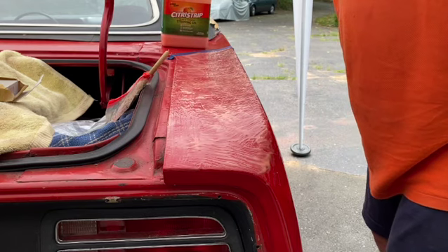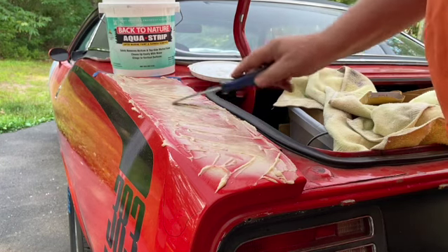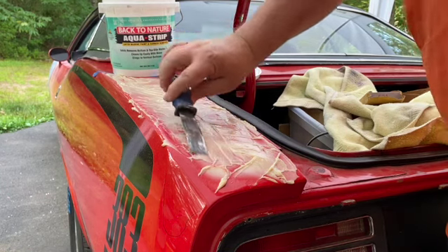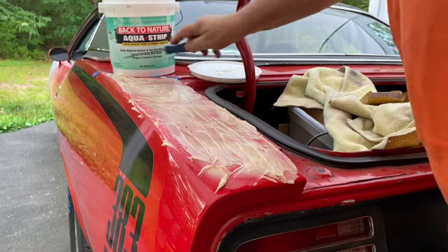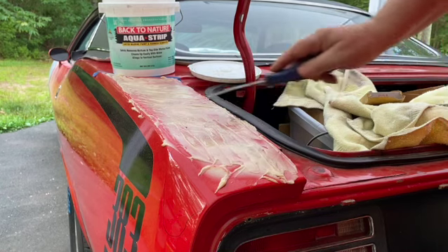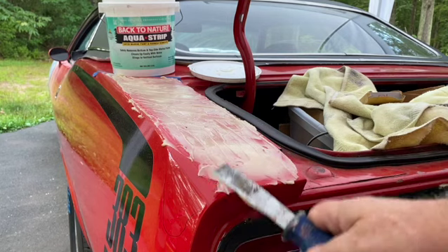On this side I've used the Aqua Strip paint and varnish remover, and it took a little while to put it on. I basically had to put it on with a putty knife — it's too thick to use with a brush, although I may take a brush just to even it out, but putting it on with a brush is pretty difficult. Again, the key to success is the amount you use — can't be stingy with it — and the ambient temperature when it's put on.